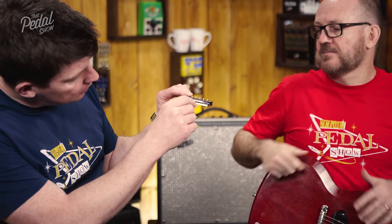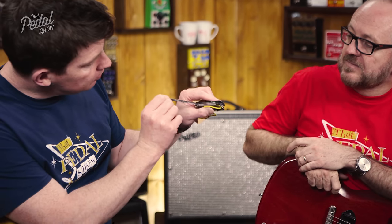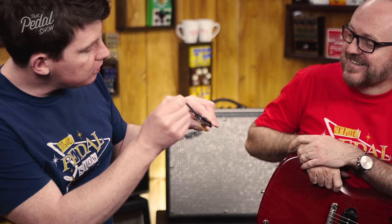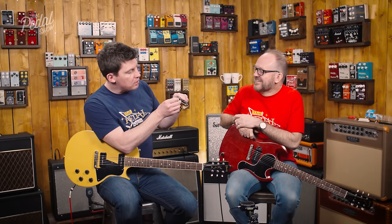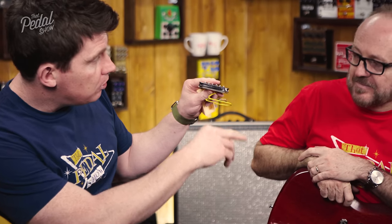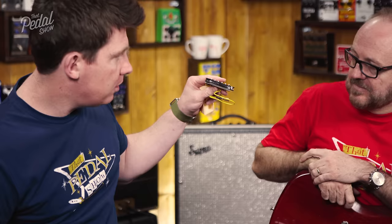Underneath this black tape here, I was going to peel it back. Can't believe I'm doing this. To be fair, it's not a brilliant pickup. Somewhere underneath all that black tape are the wire windings, and these shiny bits you can see are the Alnico bar magnets. Or not necessarily, a more modern P90 remake might have ceramic bar magnets.